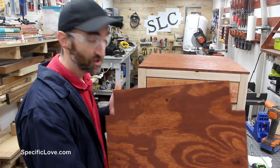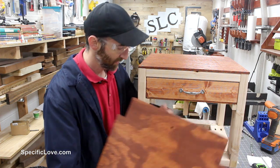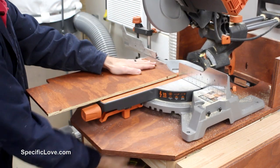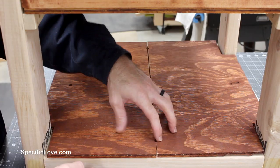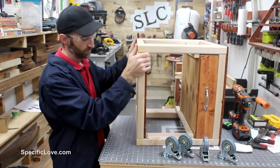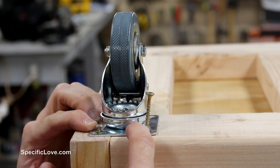I made a little bit of a mistake — I should have secured this in place before putting the drawer in, but now the drawer is just a tad too big. So I'm going to cut it right down the center, then add an additional support piece in the middle, and that should work. Now instead of the four screws I initially drilled, I'm going to add a total of eight — four to each side — for a lot more strength. With that complete, I'm going to flip it up and add the casters. It's a good idea to get all four screws fully in place before tightening them down, otherwise the caster could move on you and be a problem.